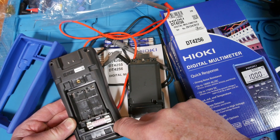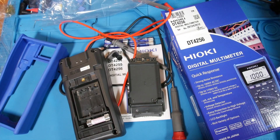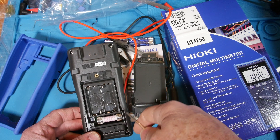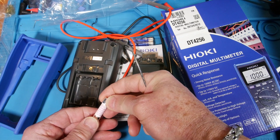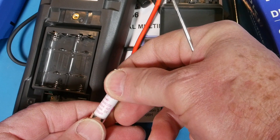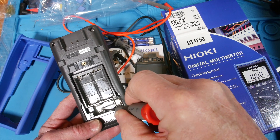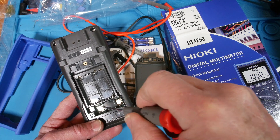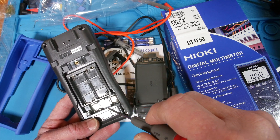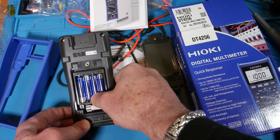Let's take off the holster. It's pretty stiff - strong, with a nice coating on the outside, slicker on the inside. It's a TPE material. You've got four screws on the outside and one holding the batteries in. The batteries are separated from the fuse by a wall around the batteries and a plastic wall. The fuse is an HRC fuse - 11 amps, 1,000 volts AC/DC, 50,000 amps AC rupture, and 30,000 amps DC rupture. The battery compartment being separate means if the battery leaks, it's hard for it to damage the board. Toshiba batteries - another good Japanese brand name.